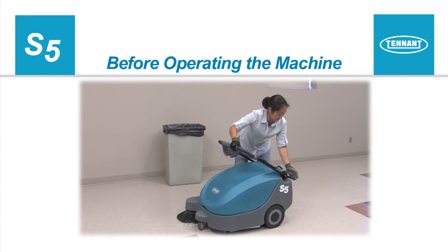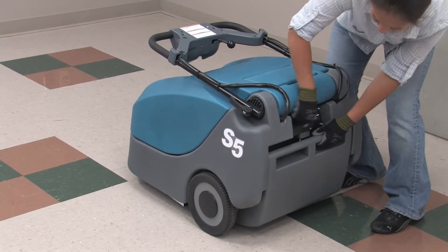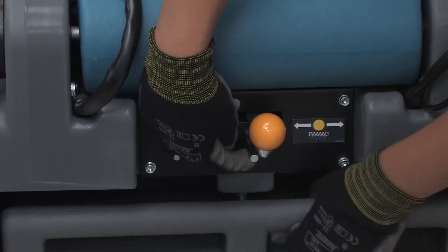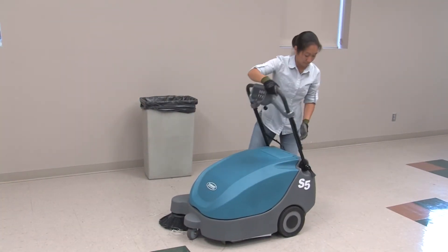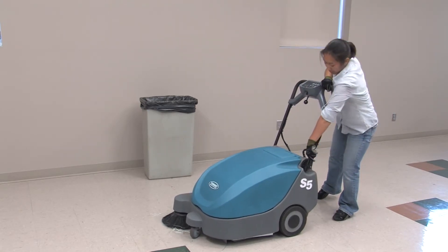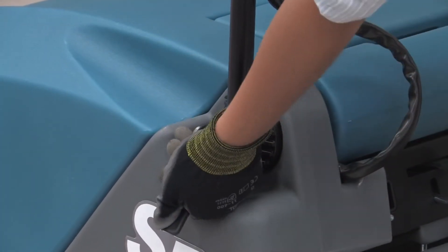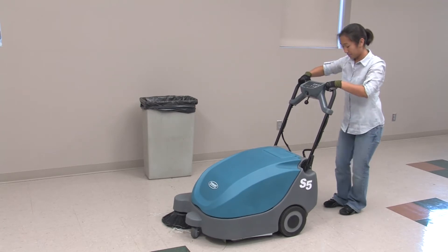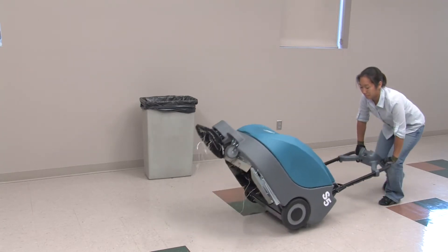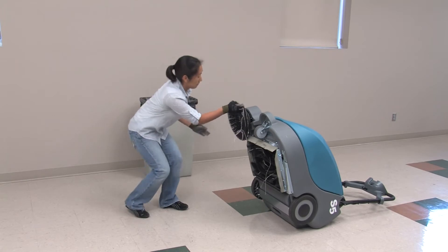Before Operating the Machine. Prior to operating the machine, there are checks that need to be completed to make sure your machine is ready to clean. Move the dust filter cleaning handle back and forth a few times to clean the filter. Next, lift the hopper locking lever and then remove and empty the hopper. The lever on the left side of the control handle allows you to adjust the handle to a comfortable operating position and also allows you to place it upright when you need to work on the underside of the machine. To release the handle lock, pull outward on the lever. Position the handle nearly straight up; to lock the handle in that position, push inward on the lever. Pull on the handle to tip the machine backward and check the brushes and skirts for wear and damage. Remove any wire, string, or twine that may have become wrapped around the brushes.